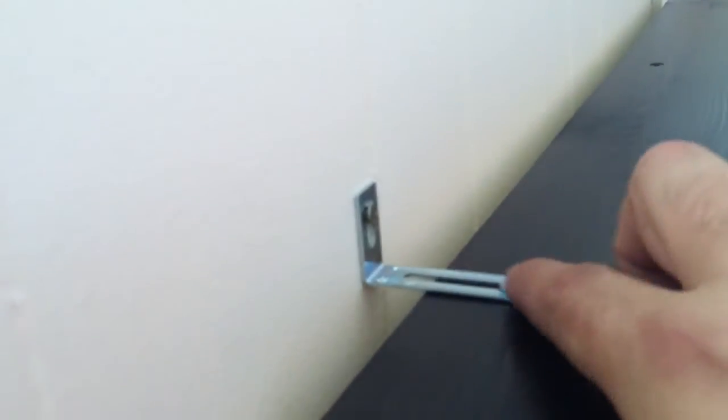Now, part of what we're dealing with is the floor isn't necessarily level to the wall, but the wall is perfectly plumb. So when I screw this to the wall, we're using these little brackets and being careful to set those. And what I use as a guide for that is the gap up here to make sure this all comes in even, because it's possible to warble this out of square when we're doing that. And then after I pushed this against the wall and set our gap uniform, because we've got a little trim here, but see, these pieces are adjustable. So you can adjust that so that as far as your gap on the wall goes, it's relatively even. We're actually out from the wall a little bit.